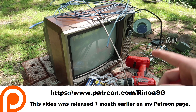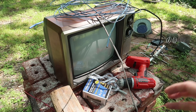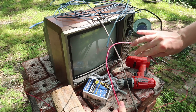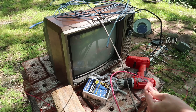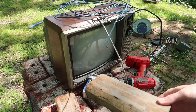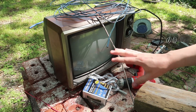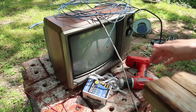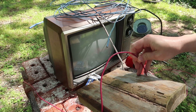I'd like to try out a helical axial mode antenna because I just don't get hardly any TV reception out here, and perhaps a very directional, focused antenna could do a good job. A helical axial mode antenna is basically just a helix of wire that broadcasts and receives along the axis of the helix. I can simplify this by wrapping it around something — I could take two 2x4s screwed together, have wire going around them, hooked on each side every half turn. That would be a nice sturdy way to build a cheap little antenna.